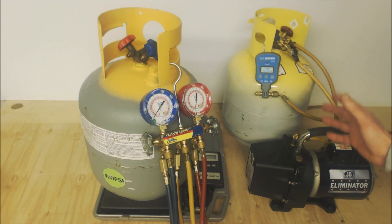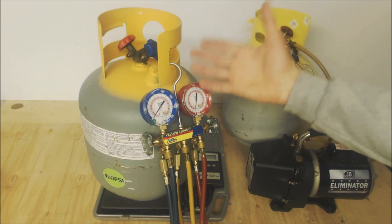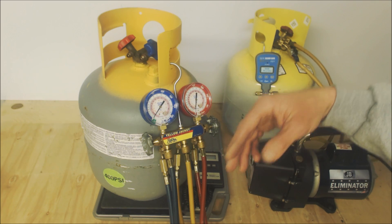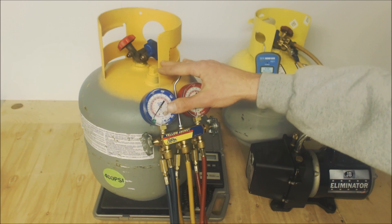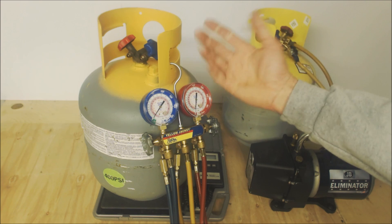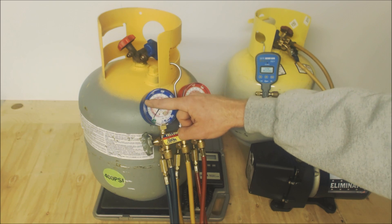This is very important to do before putting any refrigerant in, because when you drop this bottle off at the distributor or have them pick it up, they're going to put a refrigerant gauge on it — number one to see what refrigerant is in it, and number two to check if it has any non-condensables. They're checking to see if you have a mix of refrigerants or nitrogen or something else in there. If you let the bottle sit for an hour or two, it will absorb the room temperature. Once it's at equilibrium, you take a temperature reading and a pressure reading — which is what the distributor does. If the pressure is higher than what the saturated temperature indicates, you have a problem.